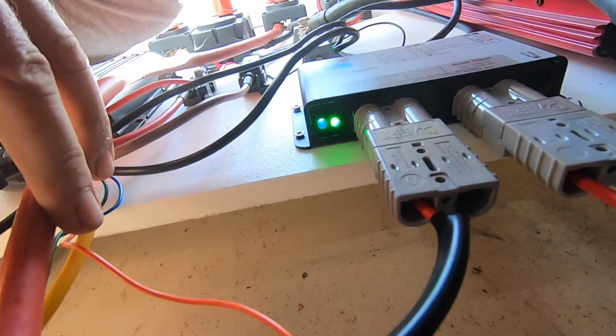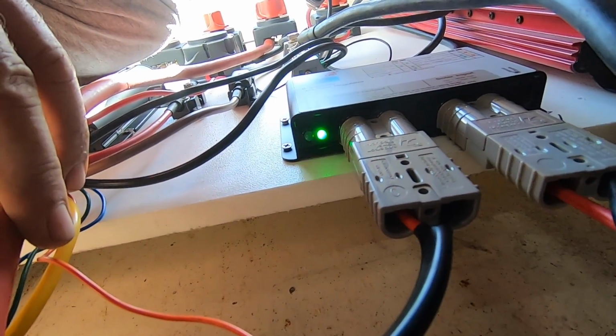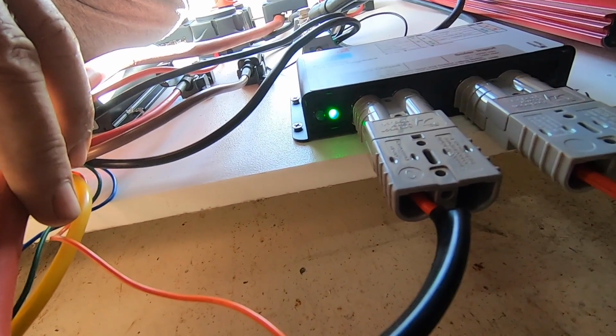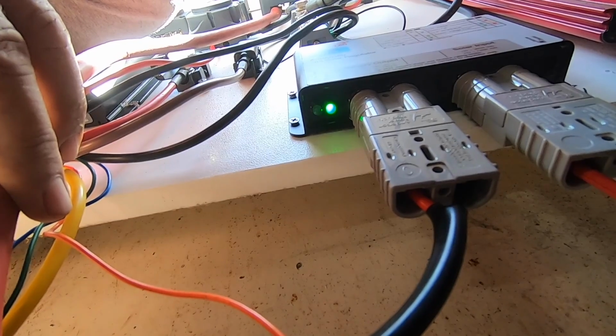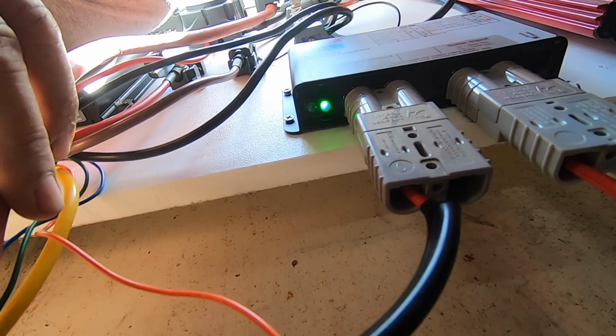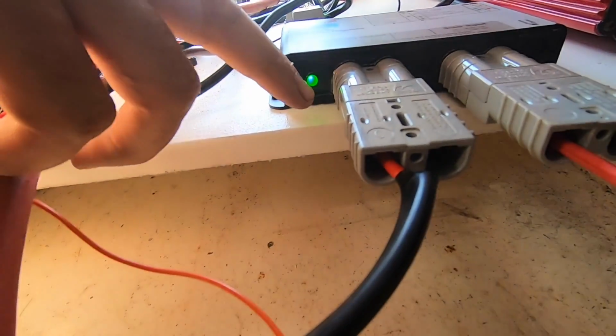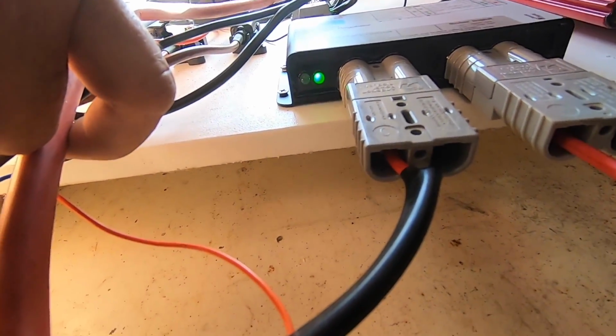Alright, how's it going? So, flashing green on the left says that the solar's connected and it's charging, and the solid green on the right says that the battery is healthy but not full. When the green here is flashing on battery, it means battery full. That's the sort of thing I'd expect to see maybe towards the end of the day. So it's relatively early still, and the fridge has been running all night, etc. So now it's time to catch up from that current draw.